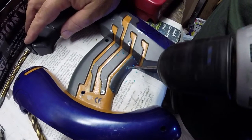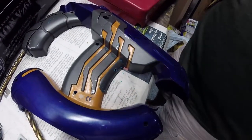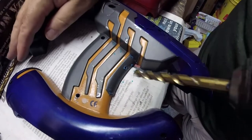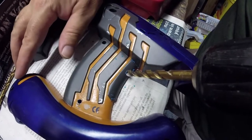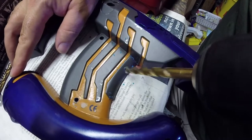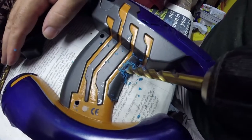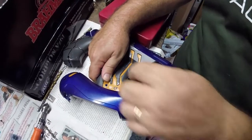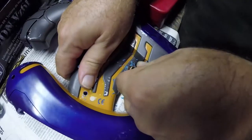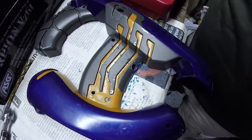We're going to drill our pilot hole here, then immediately upscale to the full size. We found the drill bit closest to the outer diameter of an airsoft barrel. Keep it slow to get it centered — too fast and you get melting, which we don't want. We want the absolute minimum size hole we can get away with. We'll come in from the inside and glue it in place.